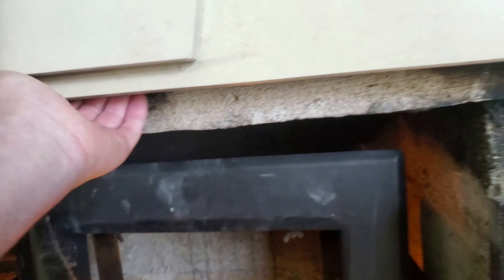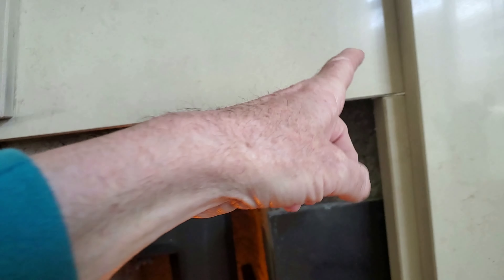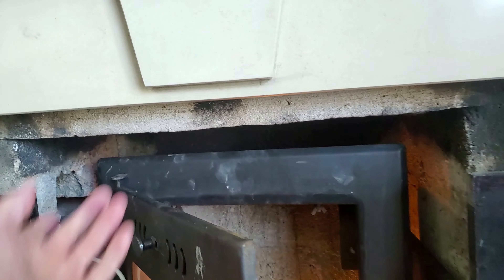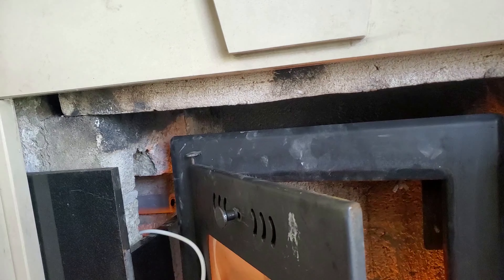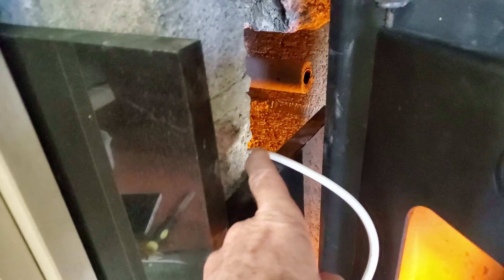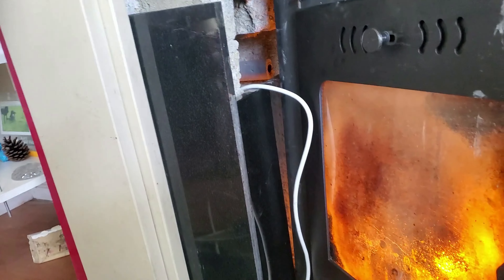I was thinking about putting spray foam behind here for safety — if you gave it a slap the glue might come away and it could fall. If you had a wee cat or a dog lying there they could get killed. By putting foam behind it, no matter how much you bang it, it won't go. When I went to get the spray foam on Screwfix they do a spray foam that sticks as well. I'll try to fill the small gap at these tiles with poly filler, then spray foam all around to seal the whole thing in — that means I won't have to box in the cement either.